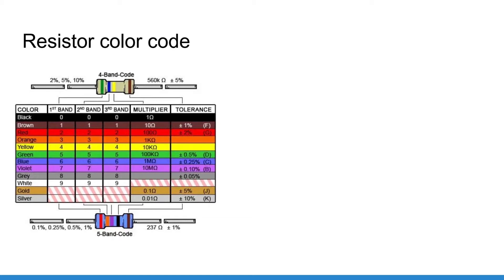You'll see either 4 bands or 5 bands on your resistor — in my personal kit I have 5-band resistors. For a 4-band resistor, the first two bands each represent a digit. For example, if the first two bands are red and red, the value is 2 and 2. You put those digits together to get 22 — this is not an addition, so it's not 4, it's 22. The third band for a 4-band resistor is the multiplier.